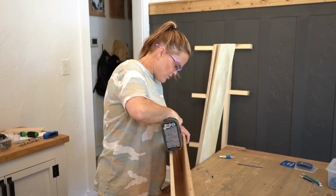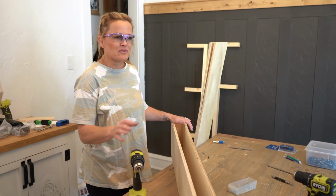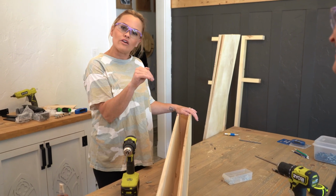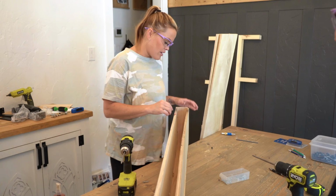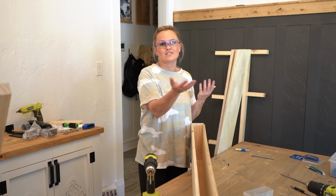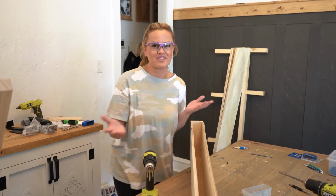Wait, and go. Well, crap. I didn't plan that one really well. So the drill doesn't fit, so we are going to now switch to a nailer for the bottom board. Not a problem. The good thing is we did pocket hole the top, which is good for strength, and it also minimizes our nail holes. So I'm gonna go get a nailer on that note.